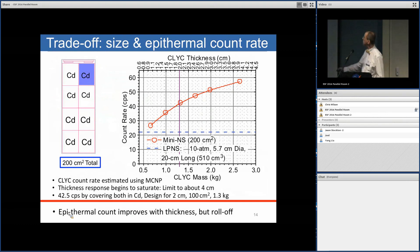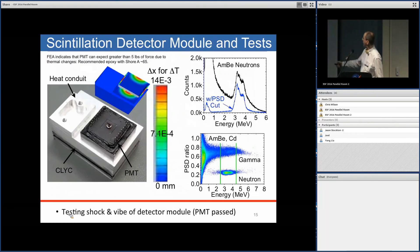The configuration under consideration shows the relative count rate — the 22 counts per second baseline from Lunar Prospector. Because we have about 200 square centimeters of detector area, we believe we'll be a factor of 2 above that. Count rate as a function of mass and thickness shows that while higher mass and thickness is better, we're constrained to about 2 centimeters by the mass budget.